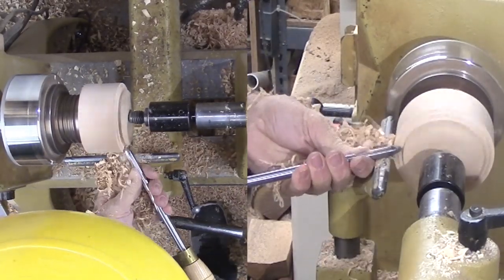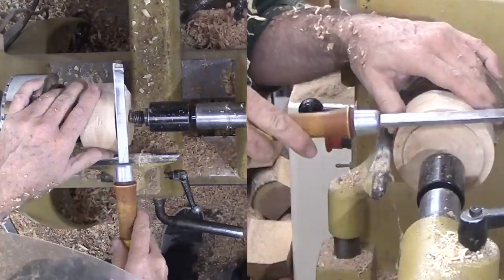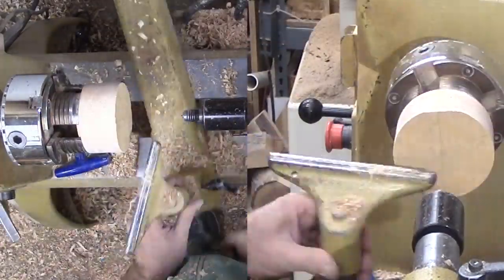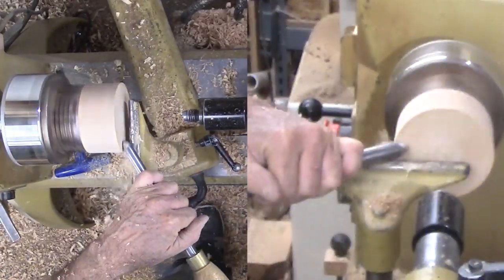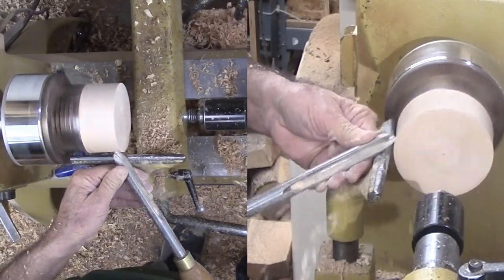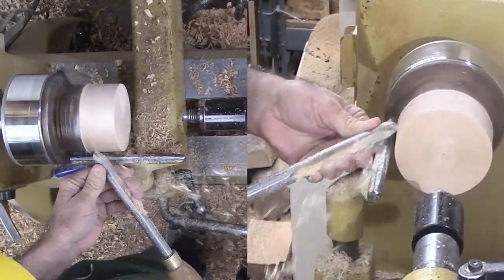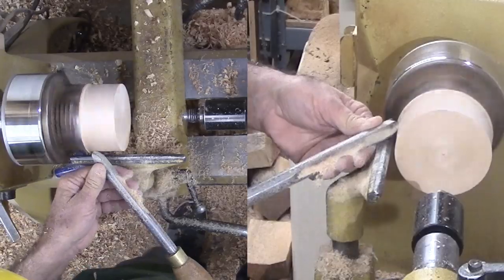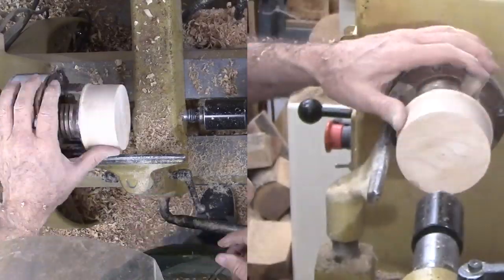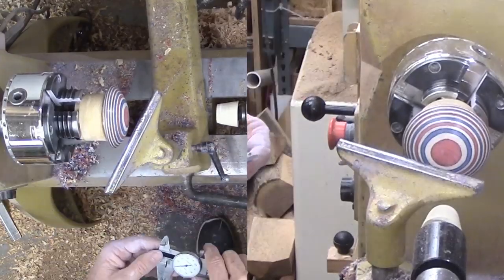This is much safer for me at least. I nearly always finish off my tenons with my skew. Then I can reverse the wood into the chuck for a reliable hold. For now, I only want to true up the diameter to be close to my ultimate objective — I'll revise it later. I lost some video where I mounted a piece of frogwood to a work platform and rounded it into a dome.